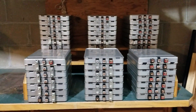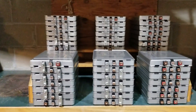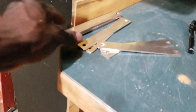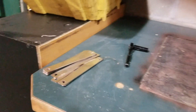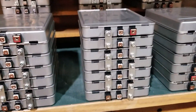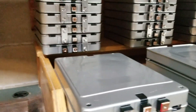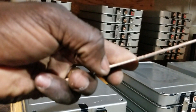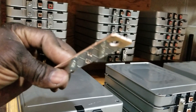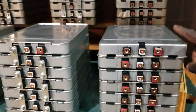Right now I ran out of those bus bars that came with the Nissan Leaf. I took these off from the other packs. Some of them you have to go the long way, the way the batteries are laid on the battery bank. Instead of buying them, I'm making my own. They are pure copper with just a thin tin coating on them. You can see on the side right there — see the copper — and when I cut it you'll see it's pure copper inside.